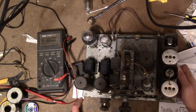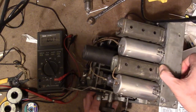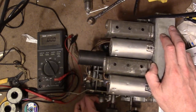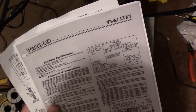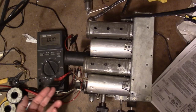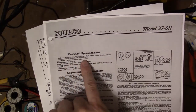I finally got everything back together and wired up correctly, so time for a power-up test. I don't have a speaker hooked up yet though — I'm going to test for filament continuity and then check B+. The curious thing about this radio, as I was reminded reading comments, is the reason for this design having extra filter chokes and filter caps rather than just using an AC transformer: this radio was designed to run off of AC or DC — 115 volts alternating or direct current.